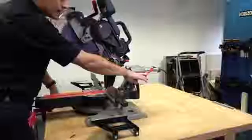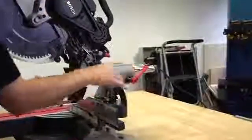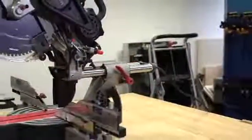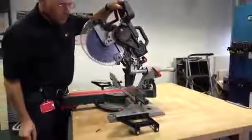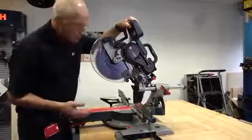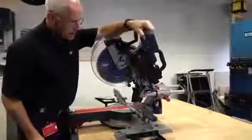We've got something again which is becoming familiar on the Bosch miter saws. We have a release lever for beveling. It's not round the back, which is a real stretch and a faff sometimes. It's on the side, and you just literally move the lever towards you to enable left-hand bevel, for example. We have, of course, a stop at 0, as you'd expect if you want to disable that. To make right-hand bevel, you simply move this lever back and over to the right you go.